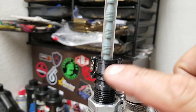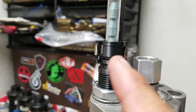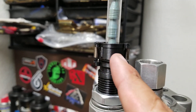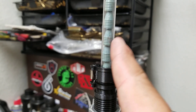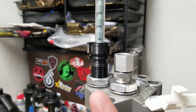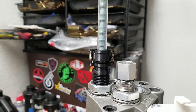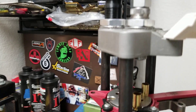Here's how it's built: I've got two springs that move this collet up and down. Inside that collet there are two 4mm ball bearings that hold the bullet in place, and there's a groove in the middle of the die. As the collet goes up, it gets into the groove, allows the bullet to drop down, and therefore you get a bullet on your case.